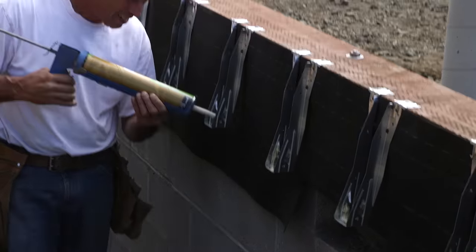If you're building a wood floor, you're building in opportunities for squeaks. One reason to have a comfortable crawl space like this is that if you have a squeak, you have at least a fighting chance of getting under there and fixing it. I mean, they can be found, they can be played with, more glue, shims, those kinds of things can help. There are people who specialize in absolutely silent floors, and I expect that this is going to be a silent floor. I also expect that if there's a squeak, I'm going to find it and fix it.